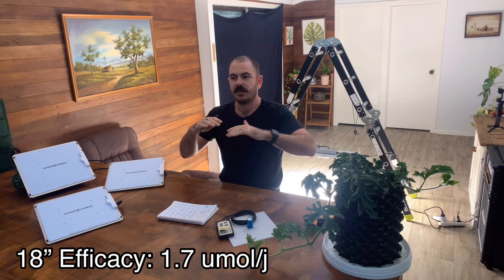That 1.7 is taking into account the inverse square law, and there are no reflective walls around the area being measured. You will gain some of that back if you were to hang it higher within a reflective grow room. But 2.2 is a fantastic efficacy, especially for a light of this price. It's not really surprising given all of the components that have gone into the light, like the MeanWell driver and the Samsung 301B LEDs, but it's good to see that it's still putting out that high efficacy.